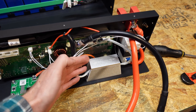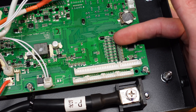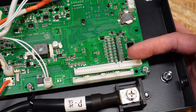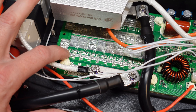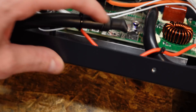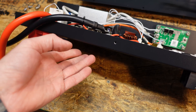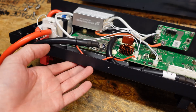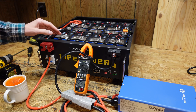That 200 watt resistor is much larger than expected. These must be the bleeding resistors for passive balancing — passive balance burns off excess energy through resistors. The FET transistors controlling the on/off power are on the other side of the board, with a very large heat sink. That design actually uses the entire steel front panel as a heat sink for the heat generated by those transistors, which is very clever.